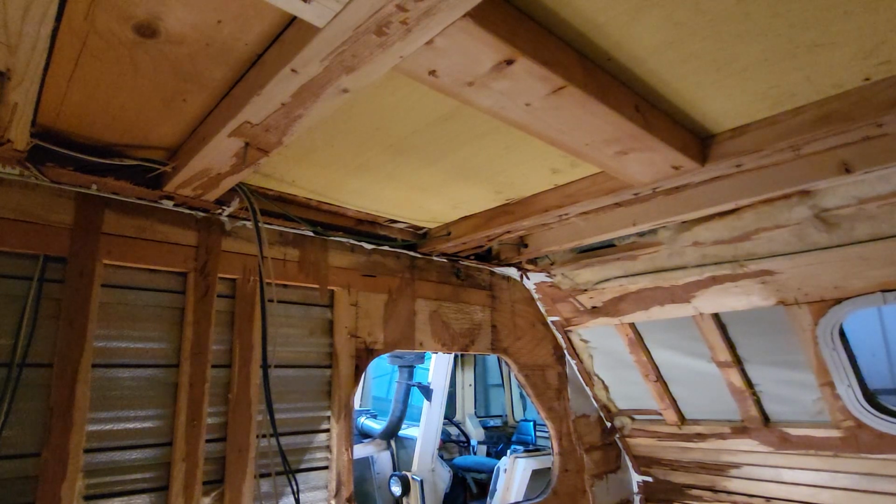I feel like I should do it where I do the 1.5 inches flush with the studs on the roof, and then the other inch on top of that so there's no seams, and then I do the sheeting on the roof, and well, I wire the lights before that, do the sheeting on the roof, and then frame the walls out to the 2 inches, do foam, and then sheet the walls. Or did I just describe two scenarios of the same thing? I think I'm too tired to think about this.